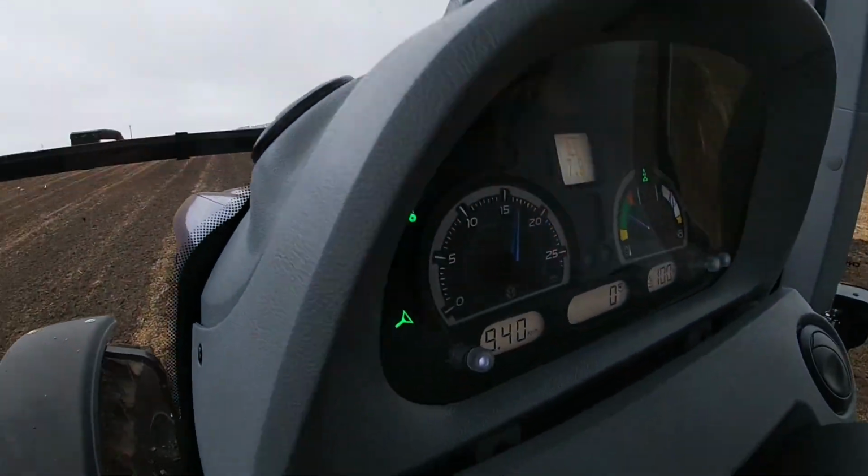So like on a power harrow, with my one you have to put the PTO in, put it into 1900 revs and drop it down. With this, you put it in gear, PTO in gear, and you just drop it down and it will set its revs and everything. So therefore it should save on diesel, it should save on AdBlue. We're running at like 1600 revs there.